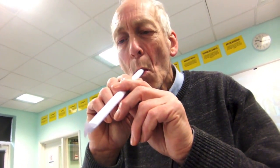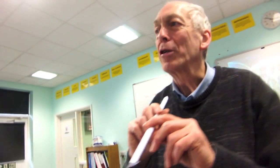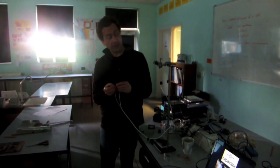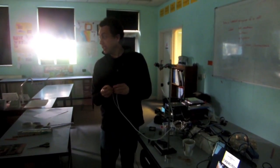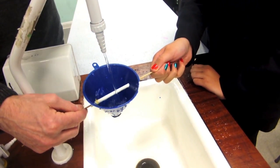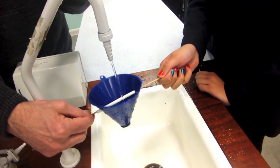The sound is made by the paper flapping against the end of the tube. Synthesizers use capacitors to make the same string of clicks. The capacitor can be charged up and then discharged. This bucket is an analogy — we fill it up till it reaches capacity and then it tips out. And every time it tips, it's like when that paper hits the end of the tube: you get a pulse.